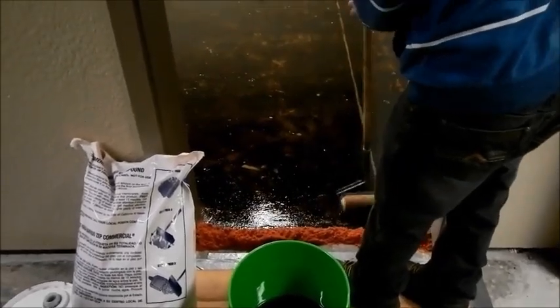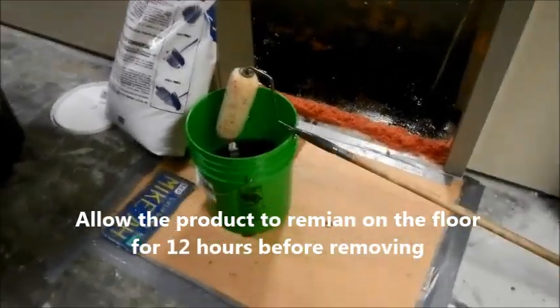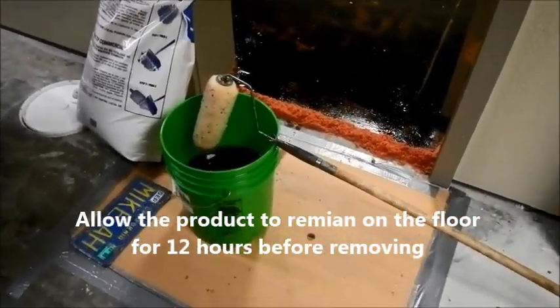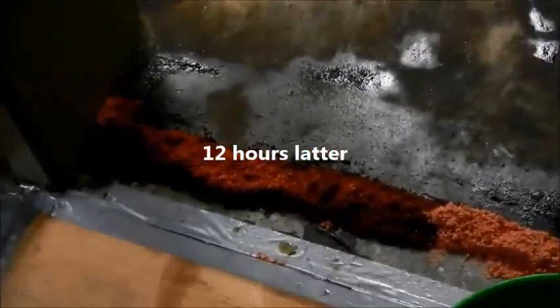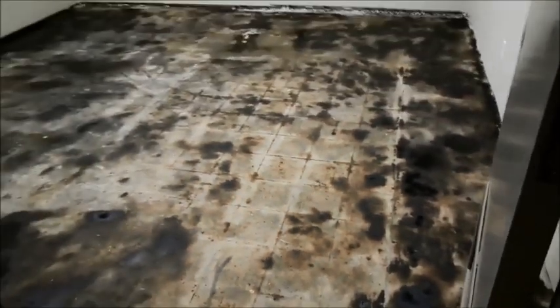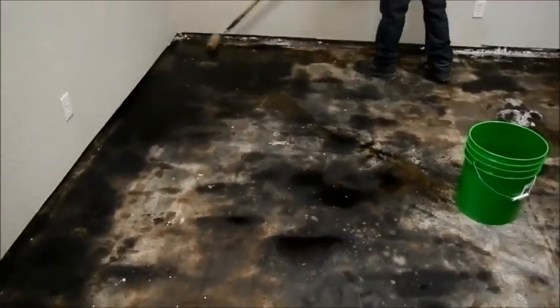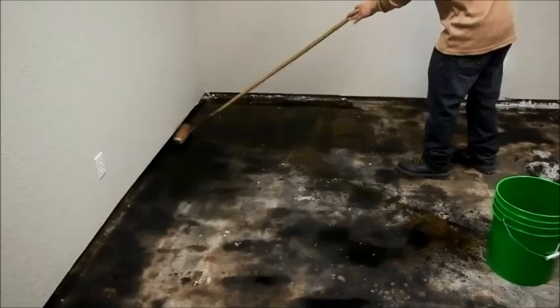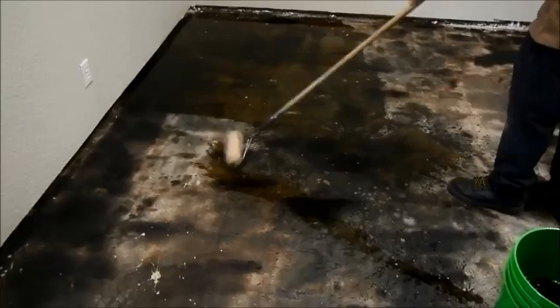The product will remain in place for at least 12 hours. After 12 hours or the next day, you'll notice that if the center of the room is higher, most of the remover will have rolled down to the edges. Where it has puddled it dried out, and lighter areas may have cleaned. So we do a quick light treatment over it and let it remain for about 10-15 minutes to re-energize the glue remover, making it easier to scrape off.